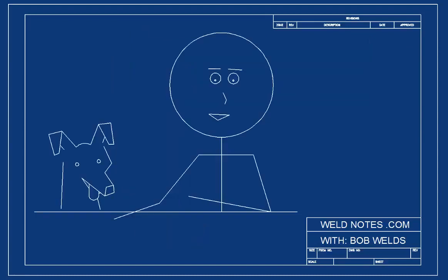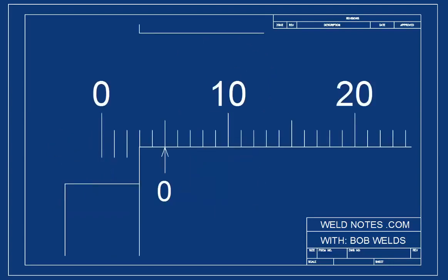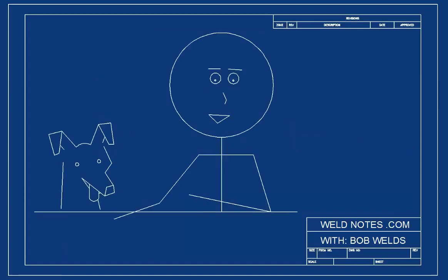That's pretty easy, right? Before we move on to the vernier scale, let me show you what it's going to tell us, okay? Let's say when we looked at the main scale, the reading wasn't right on the mark like it was last time. Let's say it looked like this. See how the mark is between 5 and 6 millimeters? It looks like it's a little beyond halfway. You see, the vernier scale is going to tell us almost exactly how far over the mark is.